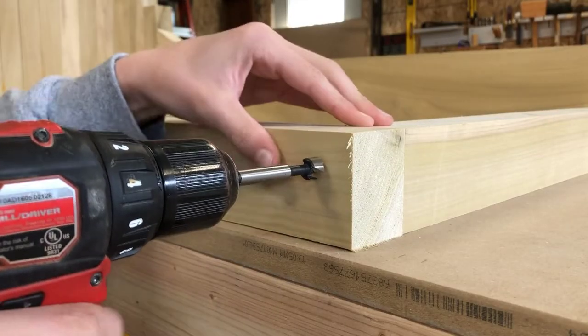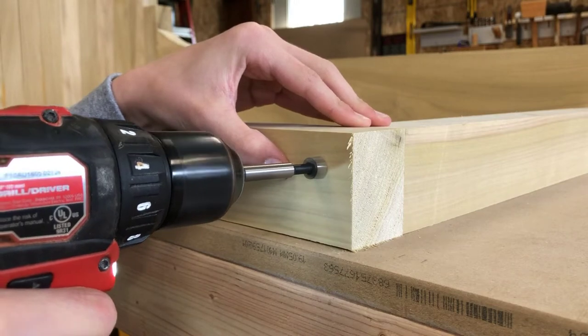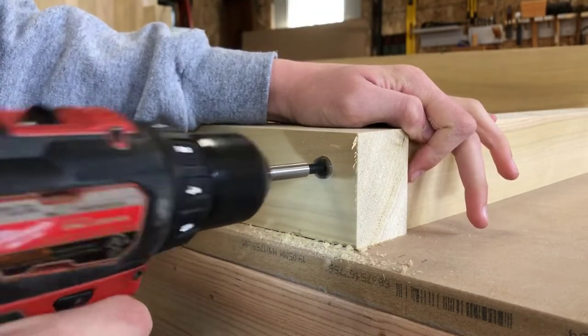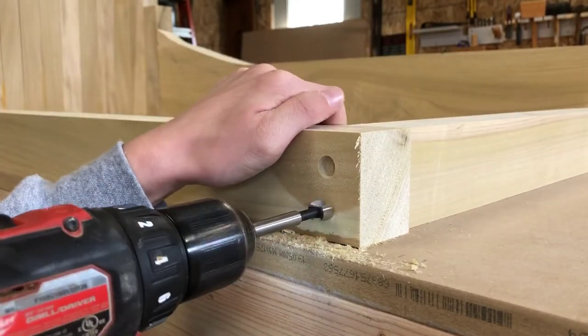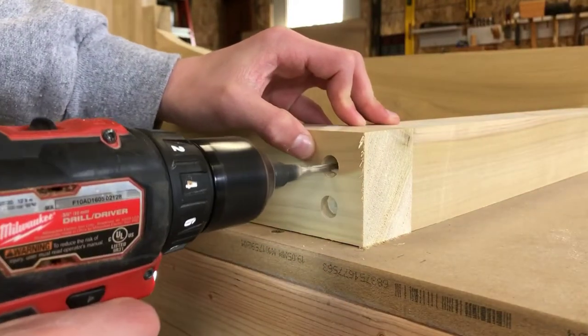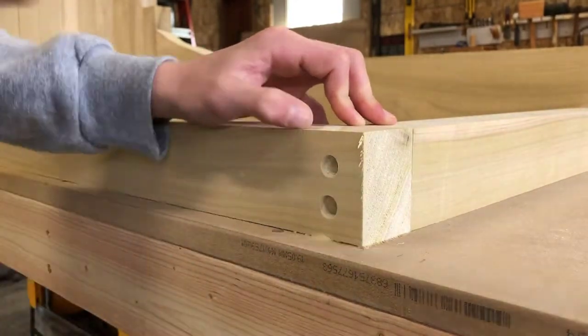After my pieces were cut, I assembled the two 90-degree joints using glue and screws. You can see that I drilled a 3/8 inch hole into the board before gluing and screwing the two pieces together. This is for a dowel that will hide the screws and make it look like I used traditional joinery instead of screws.